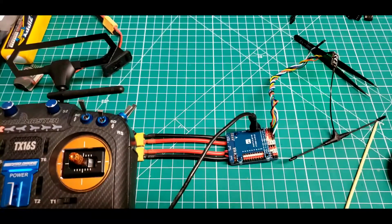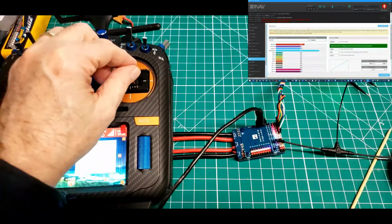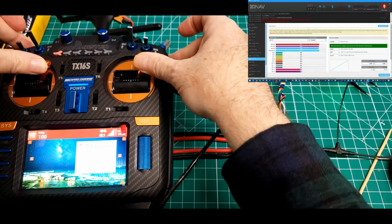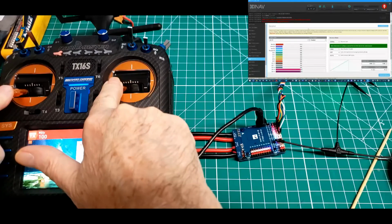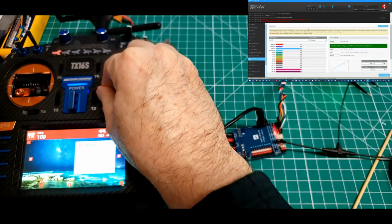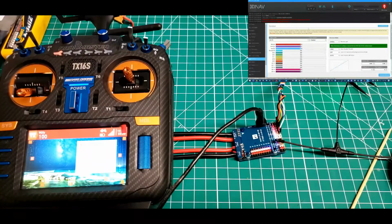So there you go. There's everything I was working with on the bench. The wiring going over to the little RC receiver, my radio sitting here, and again, you can see when I move the sticks, if you go upper right on both of them, all four of those first channels are supposed to go all the way to the right. That should signify they're set up. Bottom left, all four of those channels should go fully left. Looks like, now that goes down to 988. What's going on there? Huh. It's down in that left-hand corner. It doesn't register fully to the left. It goes up to 1102 or 1002. Oh well, it's not much. I always get sidetracked. But there you go.